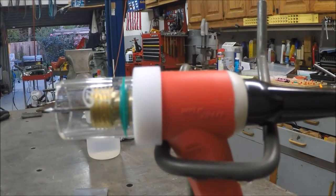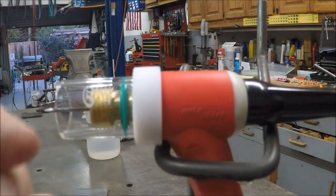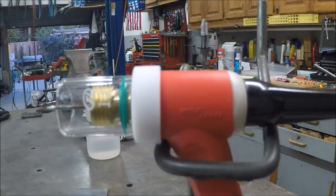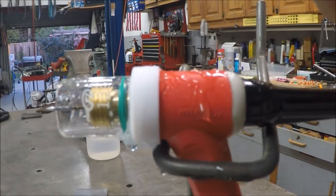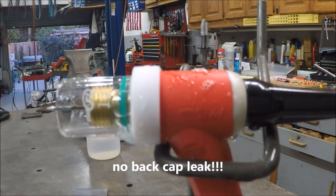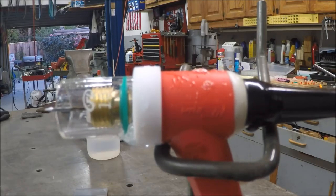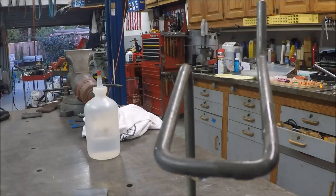Here's another test. I've changed out the front cap, made sure I've tightened the lens in real tight, got the back cap real tight — I actually changed back caps, so I'm changing too much at one time. But we'll try it. We've still got the gas at the half-cut back where it normally is. Got some liquid on it — and we still got leakage. That's no bueno. That's leaking — that's gas that's not going to my torch.